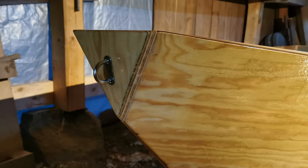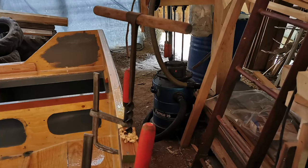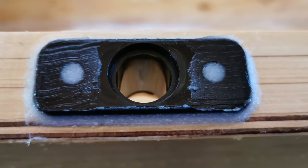I put three stainless hooks on the boat — I think they're called bow eyes. I put one in the bow and two in the stern. Here I am drilling holes for oar locks. The boat will mostly be used as a motor boat but if the motor breaks down it is nice to have the possibility to row. The oar lock holders were just epoxied into place — I hope I never have to replace them because they are quite stuck.